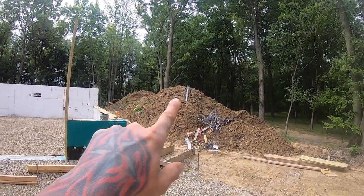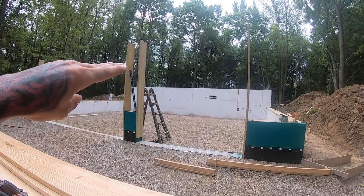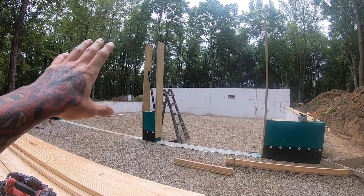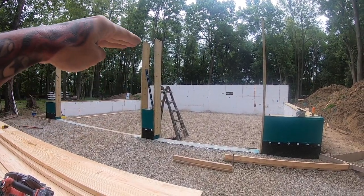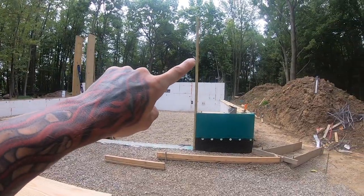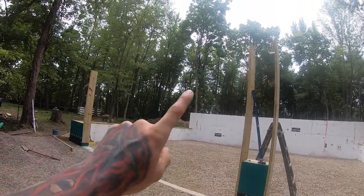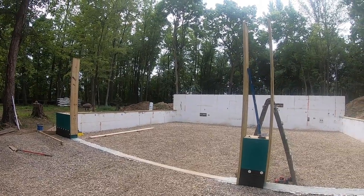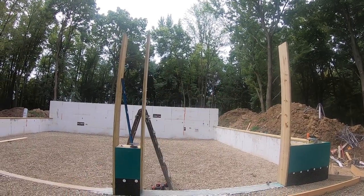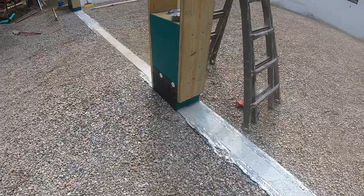Right now we've got both garages almost done. Last night I set up the laser on the tripod, shot a laser line over to the one I already had set up, and wherever that line fell on all four of these boards I measured down. One of these boards is the master - that's the height I want to go off from here all the way down. Based on that laser line I marked this one, this one, and that one, and they all now need to be the exact same height. The LVL for the header is a 95-pound board at its full 20-foot length.